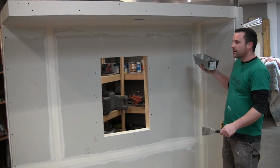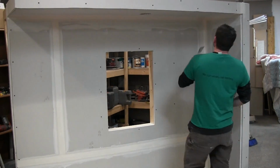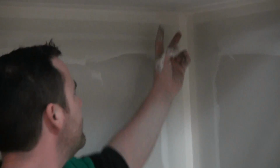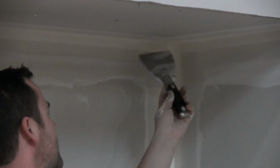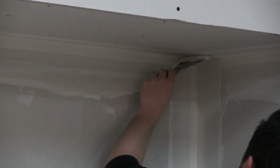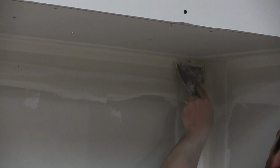So after your angle tapes are on and you have this three-way angle, what he likes to do is pre-fill 3 of the sides, so 3 of the opposite sides, because when you're doing your coating, it always kind of gets messed up in the inside corner, right? So he'll pre-fill this side and just do all the opposites of each other, kind of like this. Basically saves them a step. And with drying times and that, it saves you a lot of time as well.